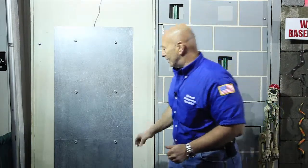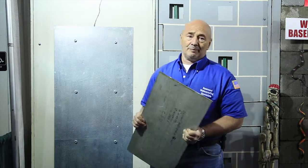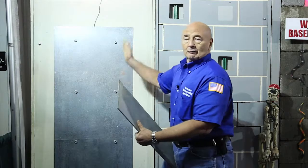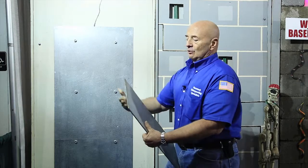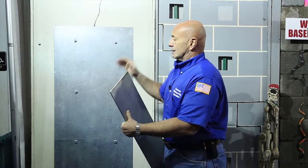What we do is we guarantee for the life of the structure of your home that that wall will not move. What we'll do is dig the outside of the house up and we take a 304 stainless plate. This has a 90,000 pound tensile strength, and on the outside of the wall after we fill the crack in and seal it, we'll then use six inch bolts and bolt it into the wall and epoxy the plate on the outside.